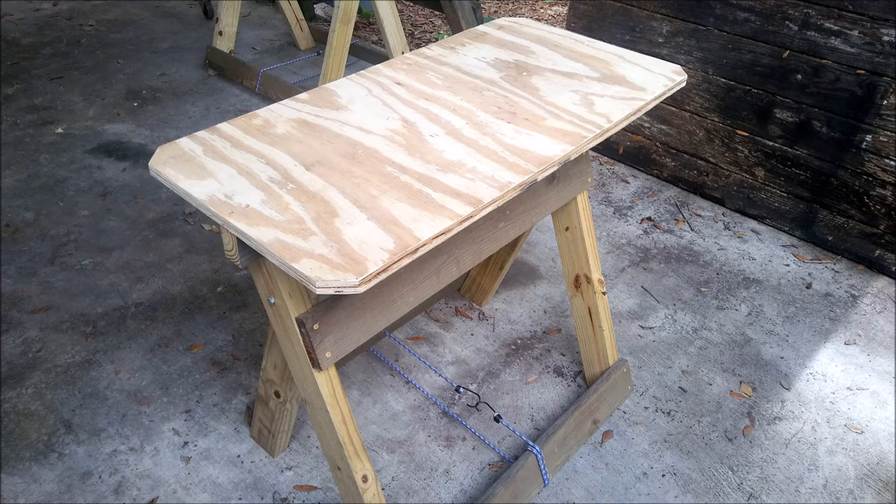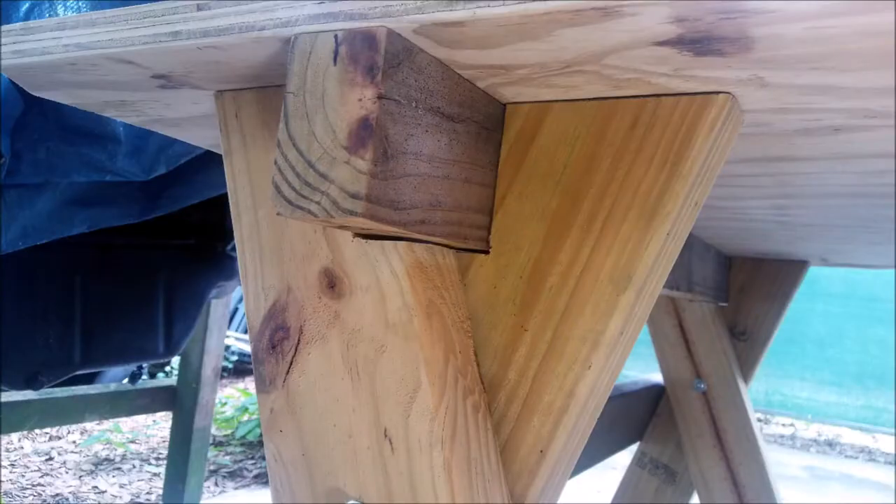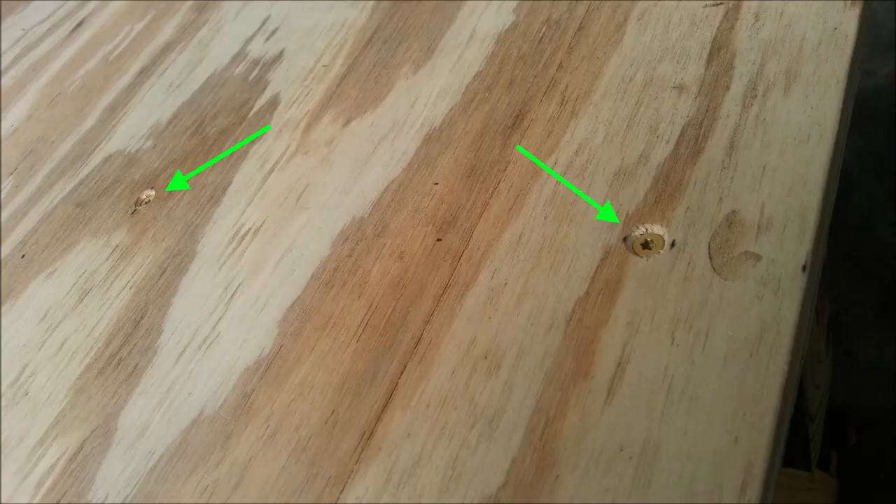The first upgrade is really simple — just a piece of lumber with a piece of plywood on top. It turns the sawhorse into a small table. I used a 2x4 cut to 2.5 inches tall to make it flush with the tops of the table legs. That allows the sawhorse to help support the table top. I countersunk the screw holes so the screw heads didn't stick out.